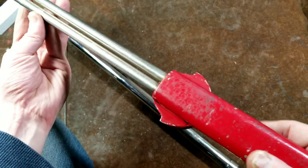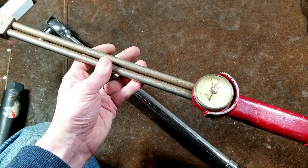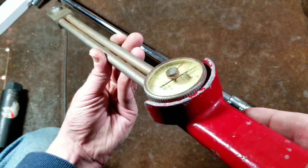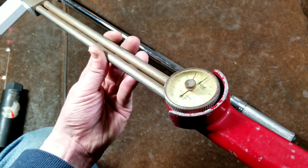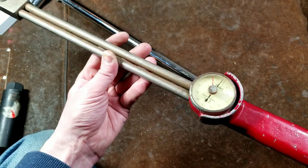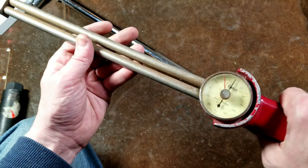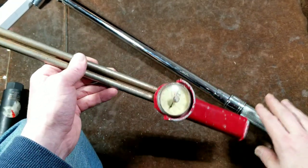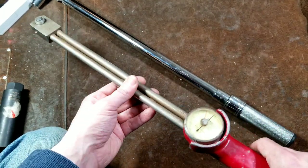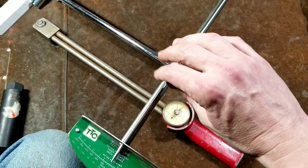Overall this was a review of a vintage tool for people who are into vintage tools, and you now have an idea of Central Tools and old-style dial torque wrenches — and that they're actually handy and convenient. One big convenience: you don't have to twist or adjust anything. Dial wrenches do require you to stare at the dial, and at a steep angle the line won't line up properly, so you have to compensate. But they're really convenient — just get the wrench, put a socket on it, and torque to whatever value you need, with no twisting handles or adjusting knobs.